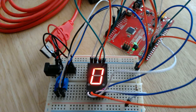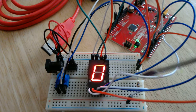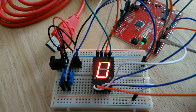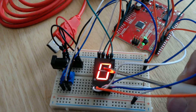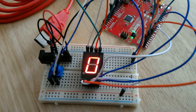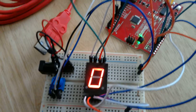That wasn't the hard part for me — this wiring was the hard part. We've got the positive 5-volt input going through the resistor into that bottom center. Because this is the common anode, in the code you write HIGH to turn something off — so right now that center LED is off because it's written high. That bit is written as a 1 and the rest are 0. That's the only thing that's a little backward with a common anode seven-segment display.